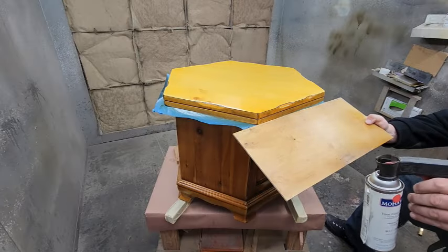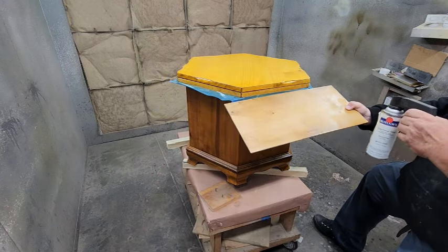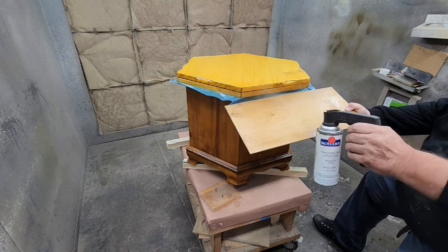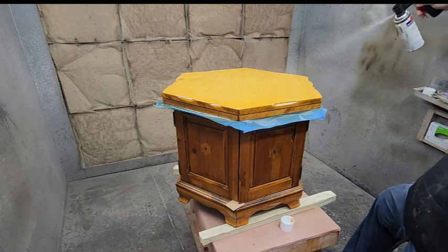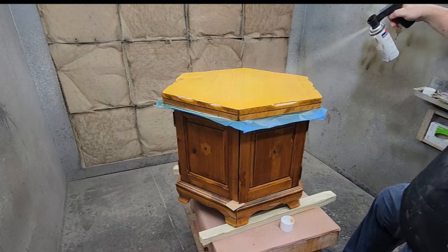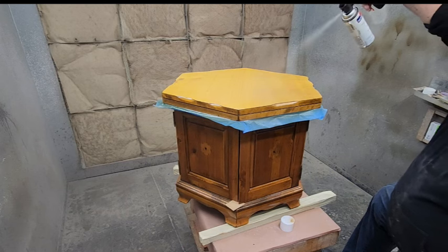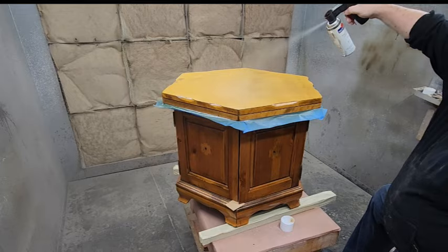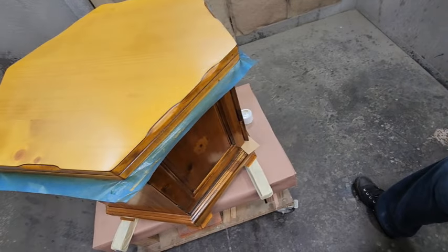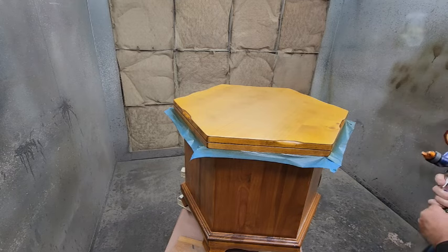Now I'm coming in with my winterset pine and I'm going to put about half the amount I need to start — I won't push to the final color right away. One reason is that as the toner dries it will darken, sometimes dramatically. You might think it's the perfect color, then it dries and it's three or four shades too dark. So I try to go about halfway, put my clear coat, let it dry, and then adjust again.